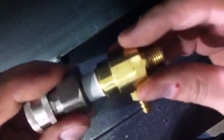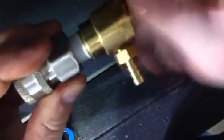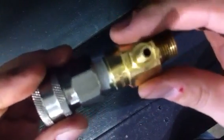When really all it is, it acts as a lubricant, and it helps you tighten this down a little better and a little tighter and create your seal. And that's all you need. You don't need 15 layers of it and things like that. So you'll actually save money on your thread tape. Not that it's expensive, and not that that's our real reason for this, but the real purpose is only as a lubricant. That's all it is.